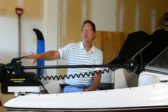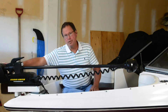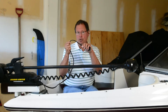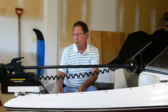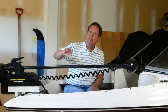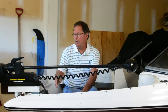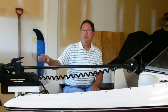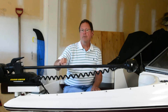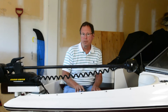The 24-volt motor putting out the same amount of power at the power head and at the bottom of the trolling motor will only be losing a quarter of the energy through the wiring in your boat and in the trolling motor compared to the 12-volt system. That's a key difference: only about 3% of the power gets lost in the wiring on a 24-volt system going full throttle, instead of 12 or 13% on a 12-volt motor. That's probably one of the more significant reasons why a 24-volt motor appears more efficient.